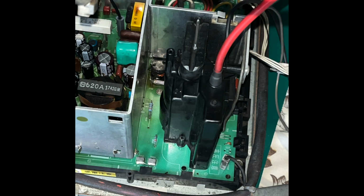So as you all have just seen, there is a sparking noise, and I managed to get some footage of it close up. Didn't quite catch the spark in that footage. I think I did manage to catch it somewhere else, but I don't know where that footage has gone. But basically, I managed to catch it by eye at least. And it looks like it's sparking from the flyback to, you can see in this picture here, there's a resistor and a coil just behind the flyback. And I believe it's hitting that. So let me change to a better picture.